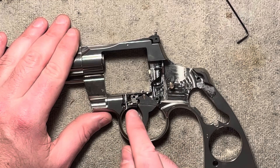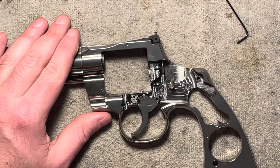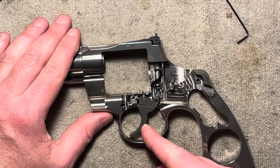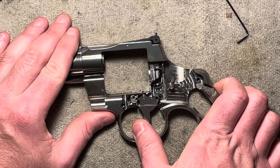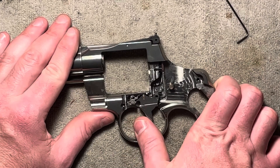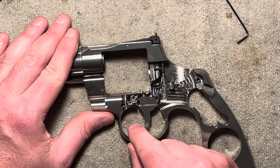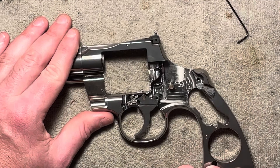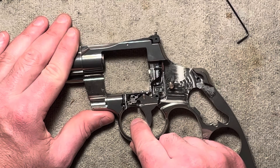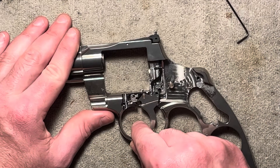That's why you have this oblong hole and kind of this free and wild spring — it's needing to move in two different ways depending on the input it's receiving. So with the trigger forward, the revolver is in a condition where it's getting ready to fire. When you pull the trigger, it pivots the cylinder stop, and you can see that the foot in the back moves down. While this is happening, the back of the trigger moving up while the front moves down — pivoting on the pin — causes the cylinder to begin rotating. Once it gets the cylinder rotated enough, based on this dimension here, it will override.